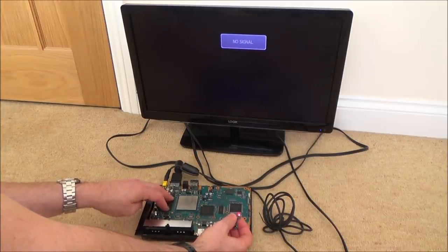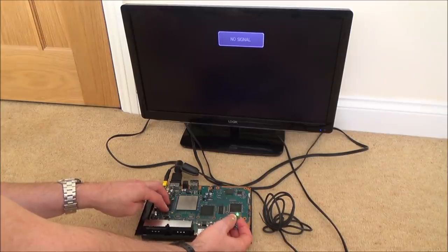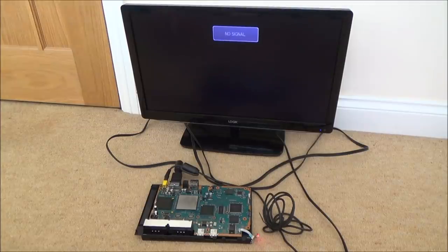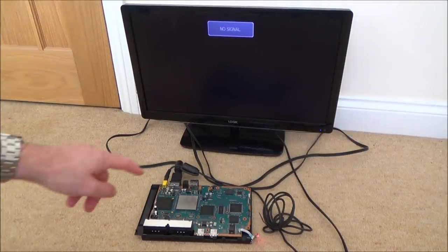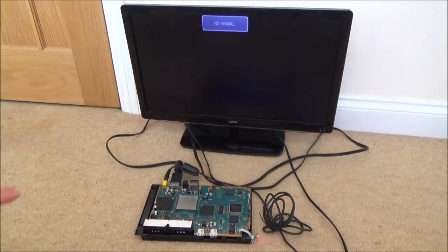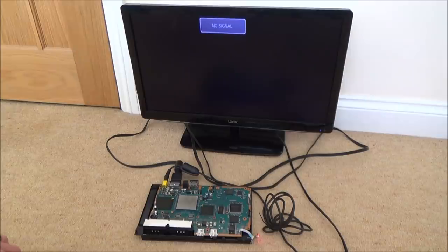No, I think there's going to be shorts underneath there. Oh well, look, it was worth a try. I haven't messed around with BGA before, and I think for the first attempt it didn't go too bad. You know, the balls look to be okay on there. In hindsight now, those ones that look close to each other have probably bridged. That's probably the problem there. I'm not going to spend any more time on this. I've spent ages on it.